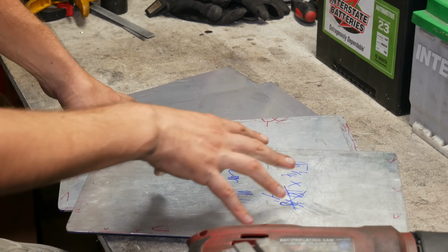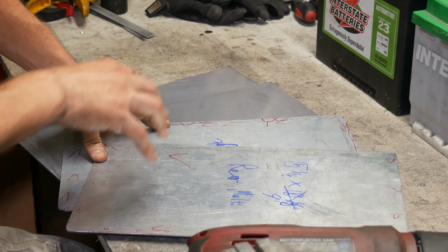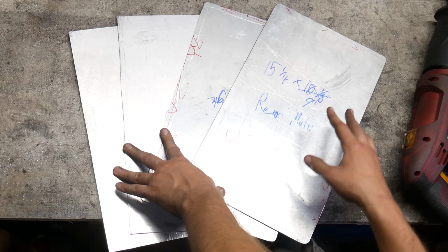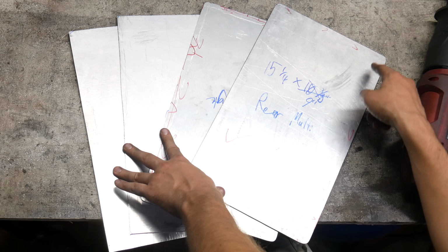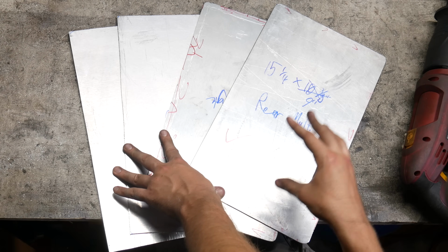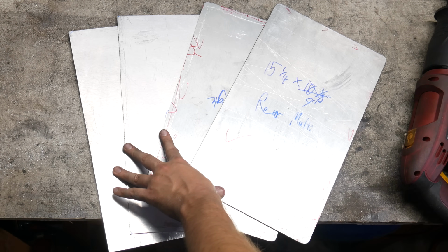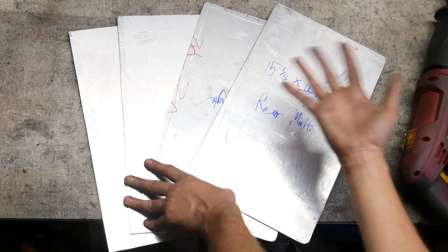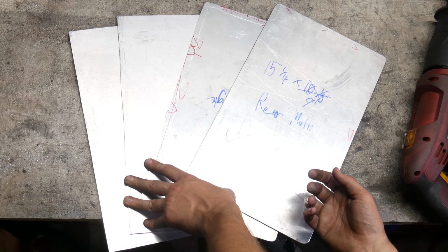Instead of the original plan of having different sizes and shapes of pieces, I think we just want all 4 of these to be uniform. So to make that happen, I think we'll start drilling the holes for the perimeter bolts that will hold the housings together on the final assemblies. Then we can put some bolts through and lock all of these together and sand them all at once so that they're totally uniform. Really, we only need pairs that match, but I figure since they're all going to be the same size now, we might as well just do them all at once.